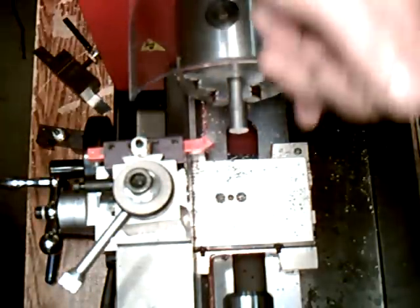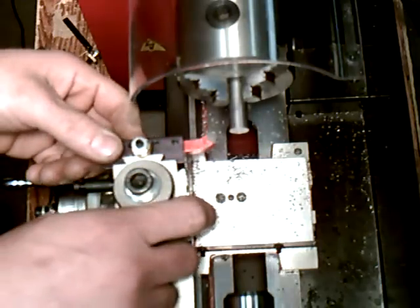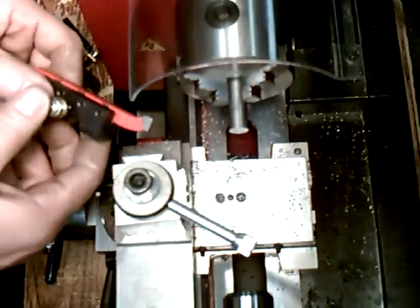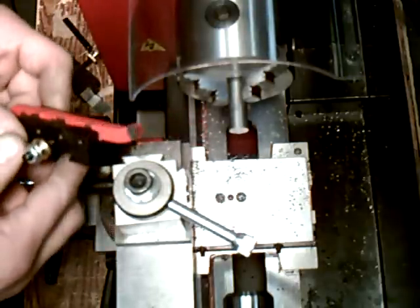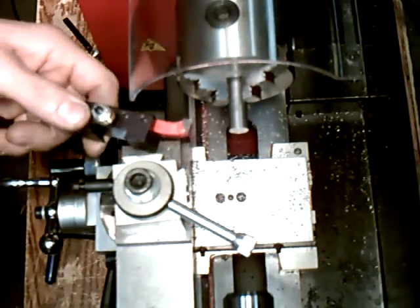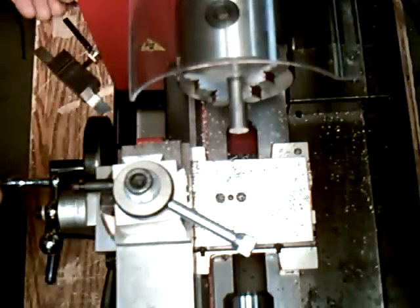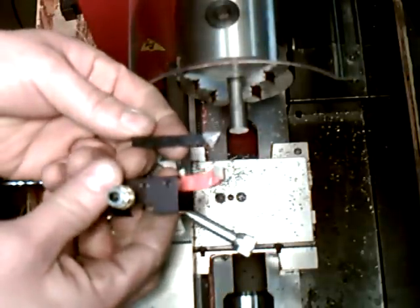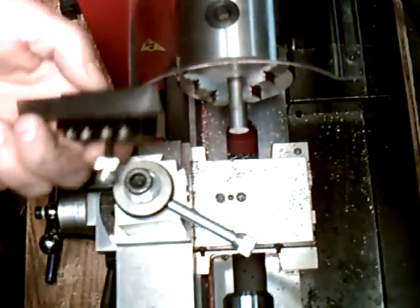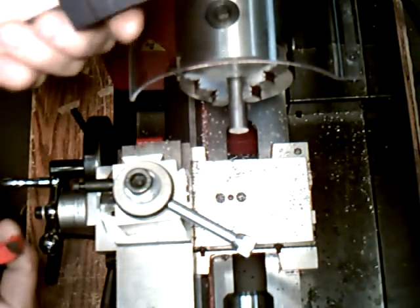Now you can see it's a completely flat cut — there is no nub on the end of the shaft there. That's the importance of the quick change tool post holder. The stock one limits you to using five-sixteenth tools, which this actually is — one of the inexpensive bits that Harbor Freight sells, but it works pretty well. With the quick change tool post holder, you can use anything from a quarter to three-eighths, even half inch, giving you so much more flexibility. Many other tool bits have carbide inserts. This one I use for grooving, here's another general one for turning. There's also a parting tool — depending on what you're doing, you might be doing some parting, or you might cut with a bandsaw and face it off. The quick change tool post really expands your options.